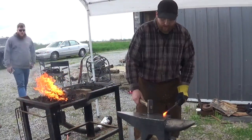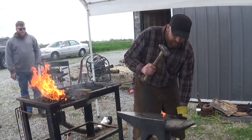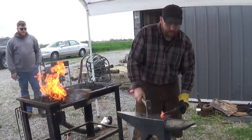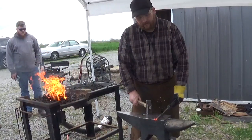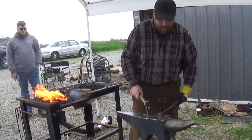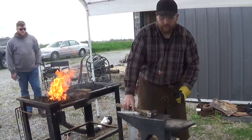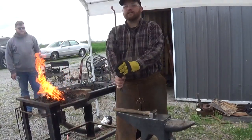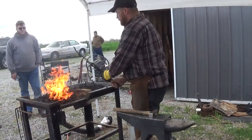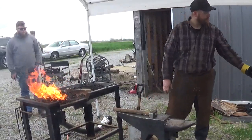Our first bend: from beyond the near side of the anvil, I'm going to drop the tong ring down and drive that forward like so. Then I'm going to rotate a full 180 degrees, stick that over about an equal amount, and then come back. Until we end up with something like that — it's a zig-zag. Just making a zig-zag in it.